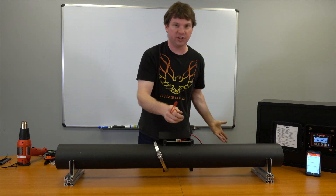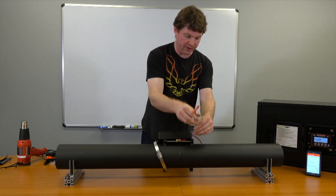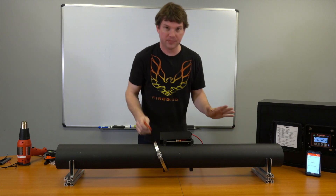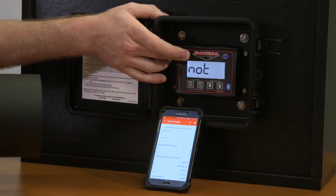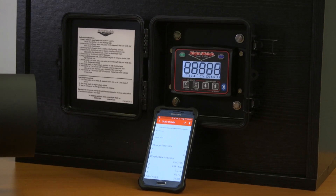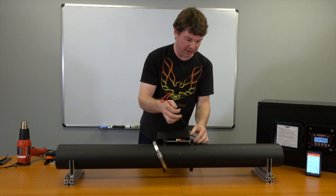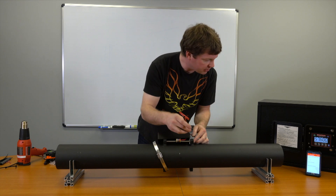To fix this, check your wiring and then come in here and loosen the two set screws. If you loosen them so the sensor is floating in there, you'll get it to come back — I can hear it ringing now. To check, just turn the gauge off and back on; it'll rescan and give us a weight. Now we're back in the sensing range and we can set it to the right tension.